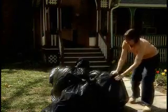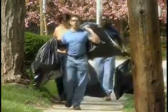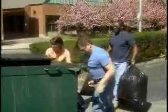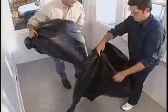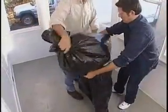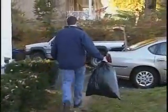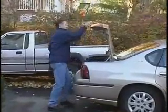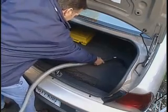Now let's talk about safely disposing of the waste from your project. Before you start your repairs or renovations, check with your state and local public health and environmental protection agencies to learn how you should dispose of the waste you create. Handle all bagged waste carefully to avoid tearing the plastic bags and contaminating the property. Remove all waste from your home at the end of the project. If you use your personal vehicle to dispose of waste, put it in the cargo area, such as the car trunk, not the passenger area. After you've disposed of the waste, HEPA vacuum the trunk.